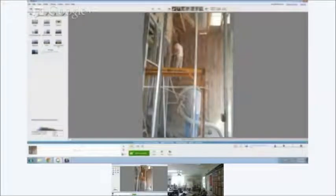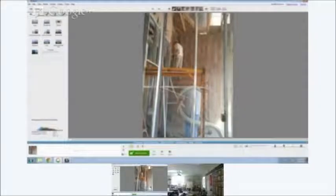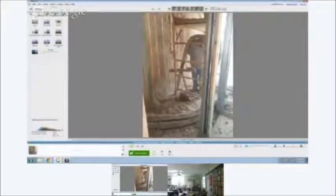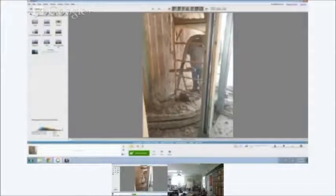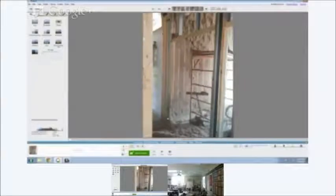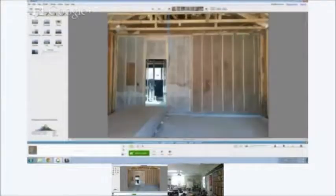Here's the truck — you can see it's going through these tubes. Here's the guy up on a ladder blowing it into the walls. I'll show you a little video of it — it's very dusty. You can see he's blowing it in all the walls, and while he's doing that, another guy has a hose sucking up all the excess insulation that falls on the floor so it can be reused. Then he takes a roller and knocks it down to make it smooth.